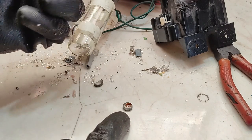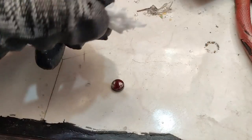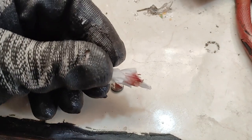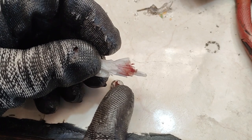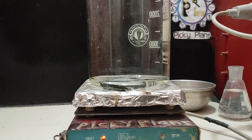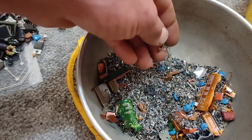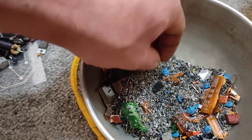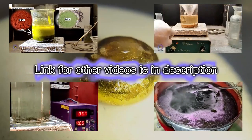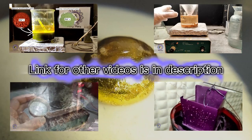To conclude, there isn't any pellet capacitor in this TV. To show you what I was actually seeking, I carried out a silver test on one of those pellets from an old computer monitor — you can see a bloody red color as the result, which is the sign for the presence of silver. I also processed those big IC-like components with sulfuric acid to open their packages, and after observing for gold bond wires, palladium, and silver, the result was negative — just transistor-like components with copper heat sinks and no gold bond wires on the silicon die. I've got a collection of IC chips, MLCCs, and blue ceramic capacitors which I'm going to process for gold, silver, and palladium in my next projects. Don't forget to subscribe so you don't miss a video — see you next time.